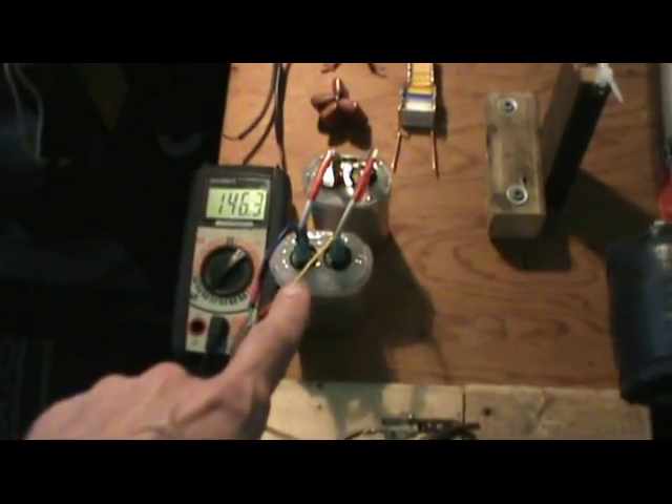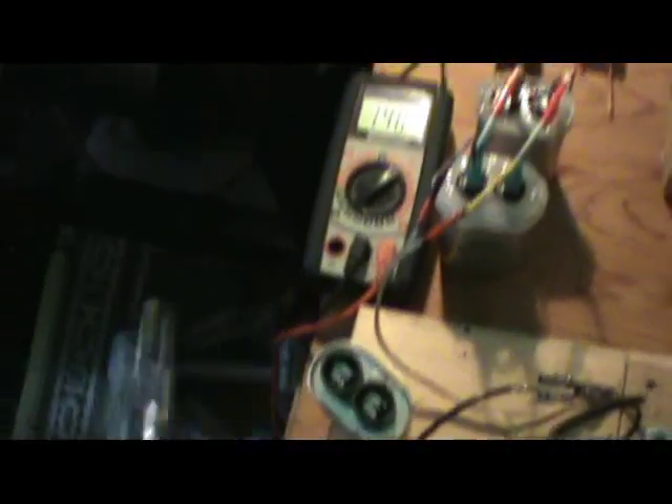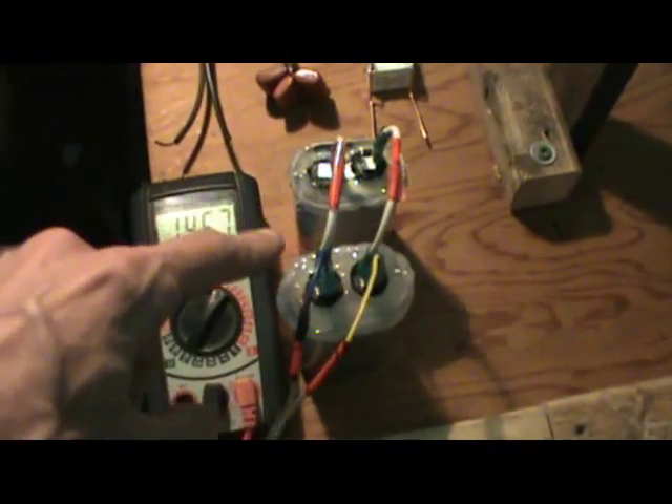I've opened them up with a simple can opener — because it looks like a can, right? And this works. I just went around it with the can opener. You've got to be careful because of the mineral oil. But basically, opening it up, you can pry that up and remove the little resistor that's inside there. So that's what I've done here — I've removed the resistors, then glued the top back down.